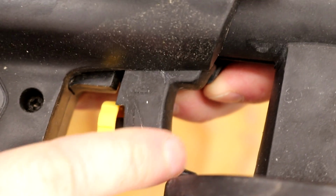How does it compare with my usual method of spraying, which is using the spray cans? Well, I get a great finish with both the sprayer and a spray can, so finish quality is great with both, that's not an issue. The sprayer is much more suited for use spraying bigger items though, because of the bigger capacity of finish that it holds, and also the trigger, which is much more comfortable to use for longer periods of spraying. And as I mentioned earlier, the overspray from the sprayer is much worse than with a spray can. It really does go everywhere.